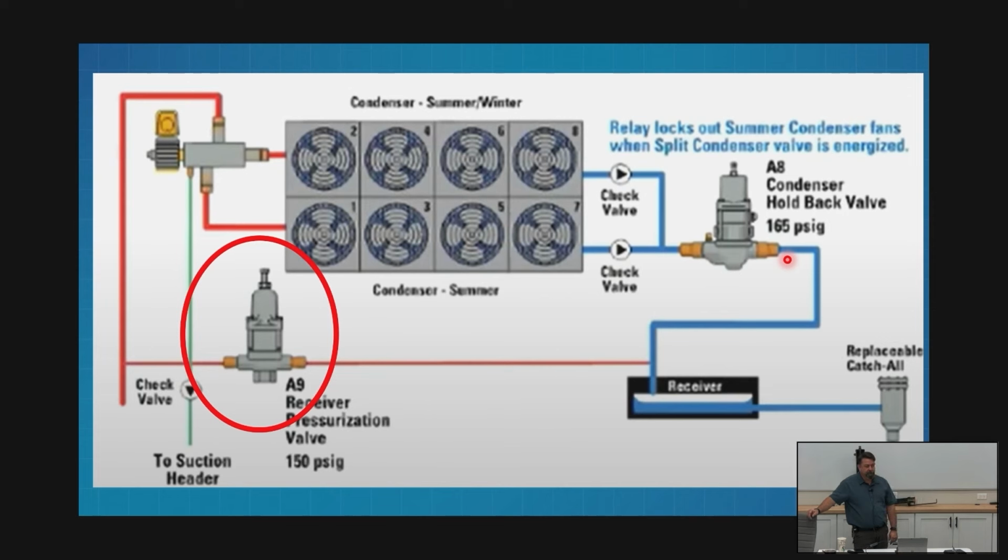What about if you have a massive leak in the store? Then you have an alarm. Then you're out of refrigerant. That will continue to do whatever it can all the way down. You're going to shut off the compressors long before this is going to come into play. If you're running out of refrigerant, your suction will overcome. You'll hit zero long before you're going to run out of discharge. Okay. Long before. Gotcha. Fair question. All right.